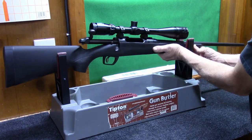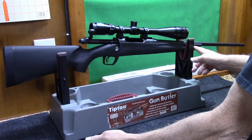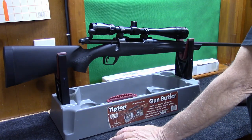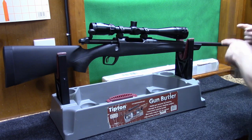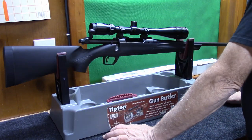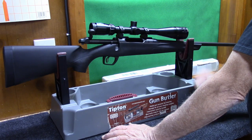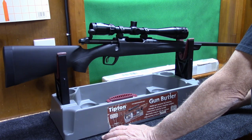The forearm on this stock was pretty flexible depending on how you were loading up or holding it - it would actually bend and touch the barrel. So I ended up taking it off and filling the whole cavity with epoxy to stiffen it up. I actually drilled two holes in the front and slid little 3/16th rods through there in the back. Roughed it up, filled it up - that stiffened it up a lot and made it a lot more consistent to shoot. I stuck this little Bushnell 24-power scope on here to help me see what I was doing a little bit.